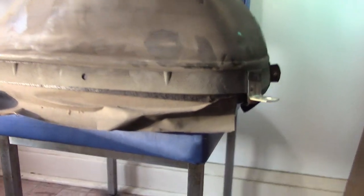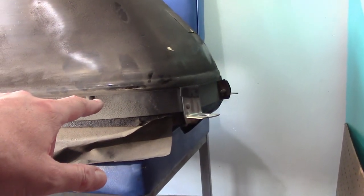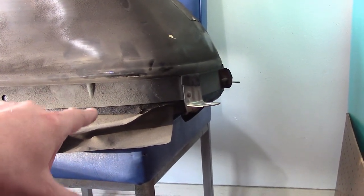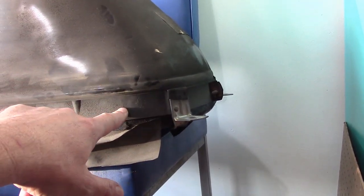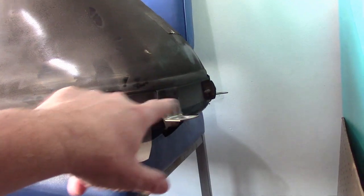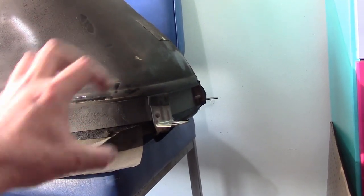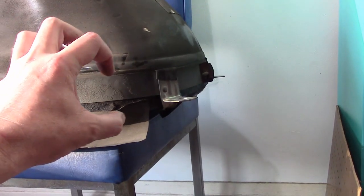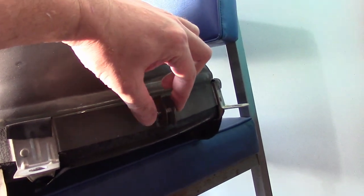One last thing — what about the band? The band is strictly for mounting it. It is not a tensioning band, so you can safely remove this. If it was a tensioning band, they're typically welded on and the glass is under tension, and the band helps keep it stable — you do not want to remove those. But this simply has a screw, and there's one on the other side too. You can loosen these up and the whole thing just comes off if you want that out of the way.